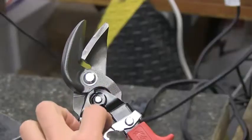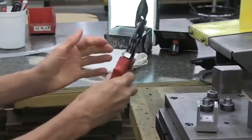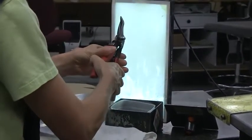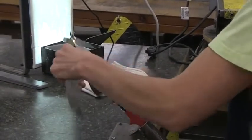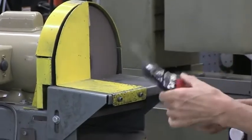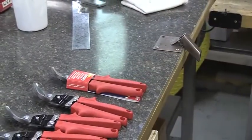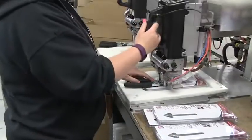The latch is quickly checked for easy clearance and no hang-up. Shaking the snip checks for any rattle. A light box is used to visually check the blade gap adjustment. A test cut checks for easy material grip and flow, followed by a manual tipping operation to ensure a clean cut out to the blade tip. Finally, the product is sleeved and boxed for shipment.